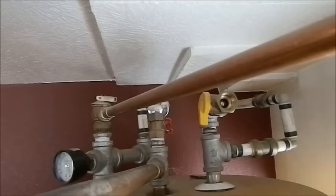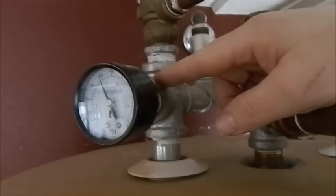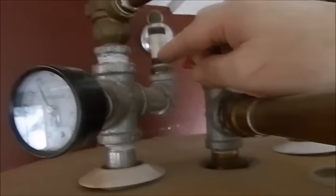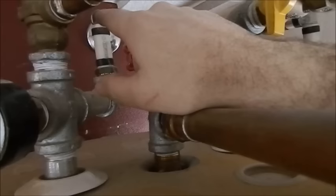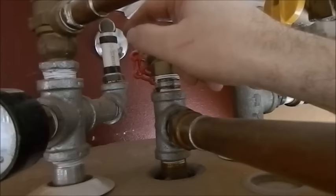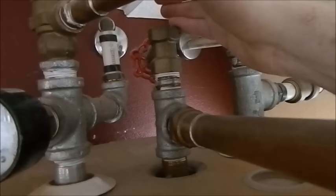This cross union here has a four-way, and the rest goes off into the house as domestic hot water. Every fixture in the house receives hot water from this tank — the kitchen sink, bathroom sink, shower, and laundry machine all get hot water from the wood cook stove during winter. It's really a nice feature, just like having an electric water heater but using wood instead of electricity.